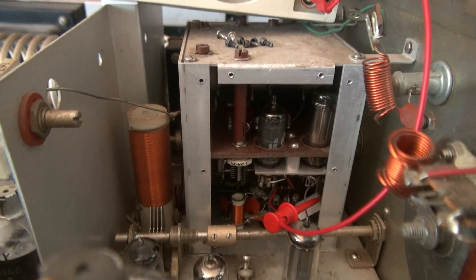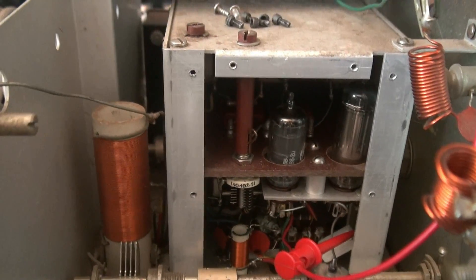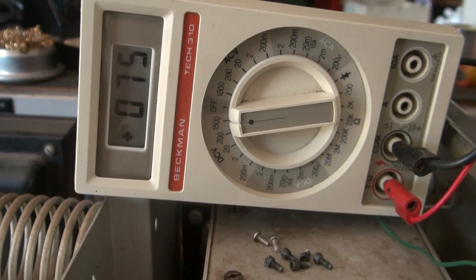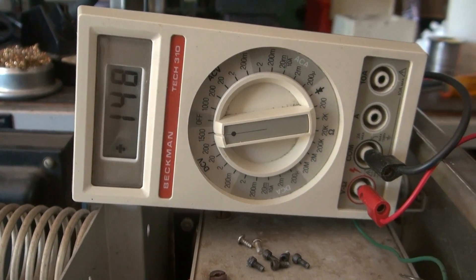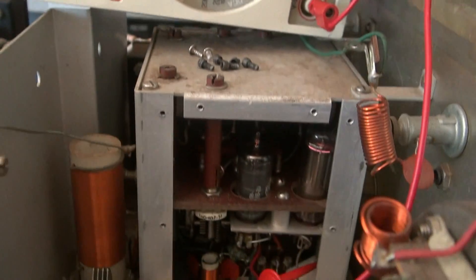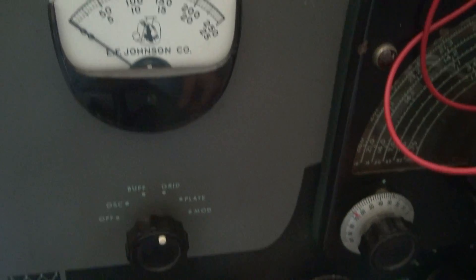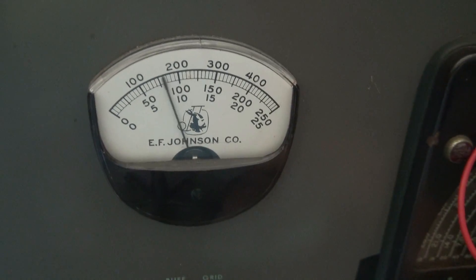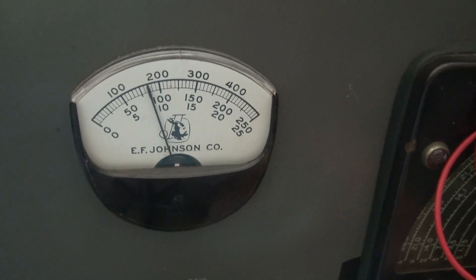The new resistor is installed and I've got a test probe on it going right to the OA2. Let's turn it on - watch our meter, she's coming up. The OA2 should start glowing here - there it goes. 148 volts. So let's say she's alive and well. The true test is whether that oscillator is running - you can see it is running. There's my grid, I should be adjusting my drive. Excellent.